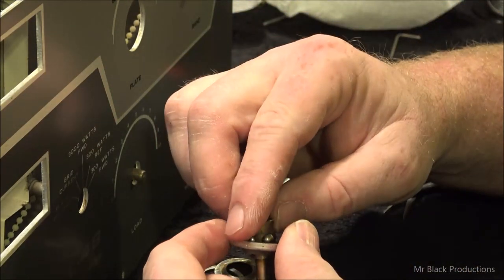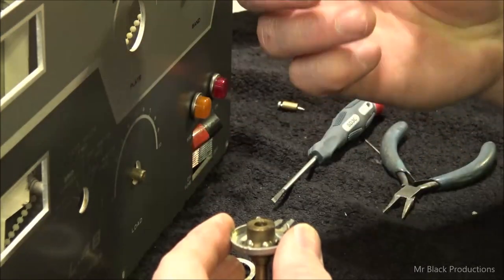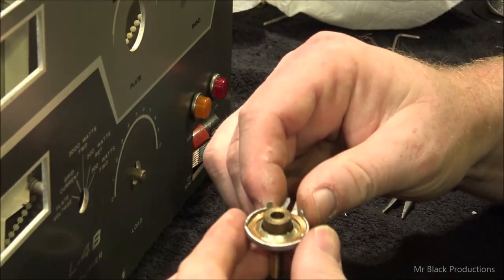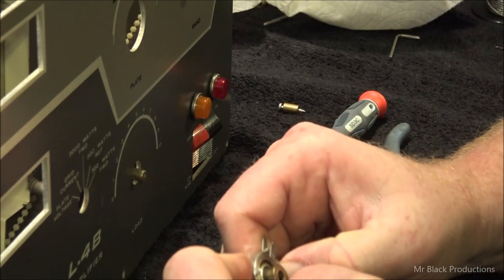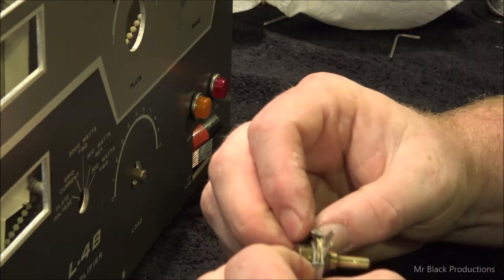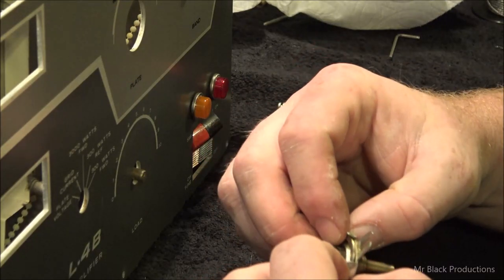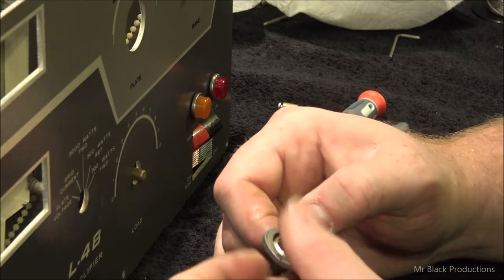So let's go ahead and put this back together. The bearings sit in the housing and ride on the raceway — there's a little indentation there. Then you've got the other side of the raceway, then our little tiny piece of copper, then our pressure plate. These four little tines are everything that controls how much pressure is applied to the spring-loaded plate, which in turn directly applies pressure to the bearing edges. If it's loose, the bearings just spin on the outer shaft and the inner shaft flows freely.